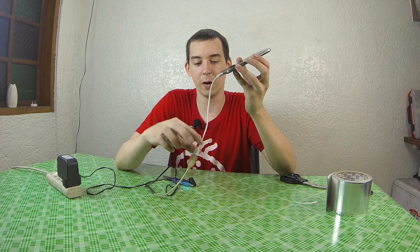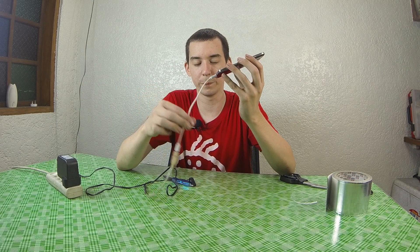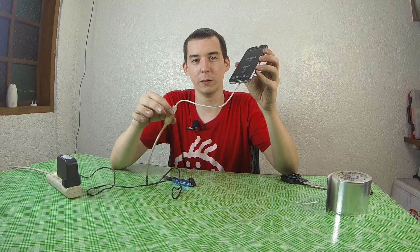The only thing to remember is that because you've shorted out the two data lines, this cable can no longer be used to transfer files — you can't move files on or off the device without first removing the foil tape. On some modern desktop computers with USB 3.0 ports that can push out more than 500mA, this modification can also be very useful, but be careful to make sure the port can actually handle the higher current.